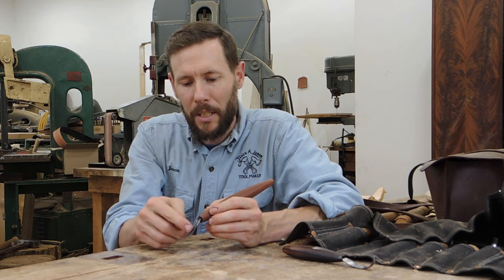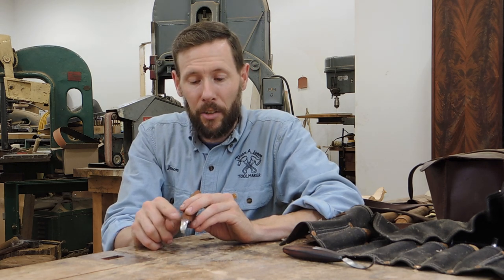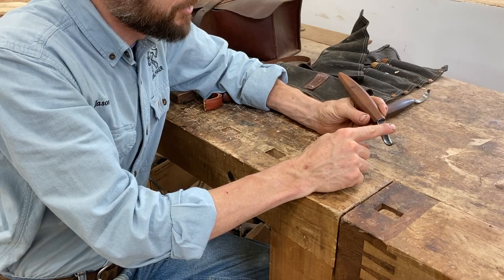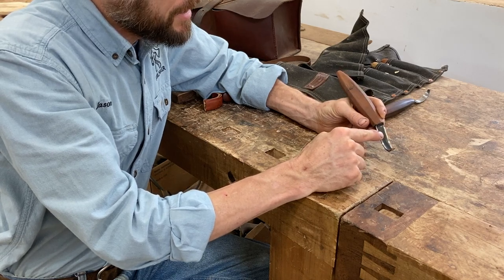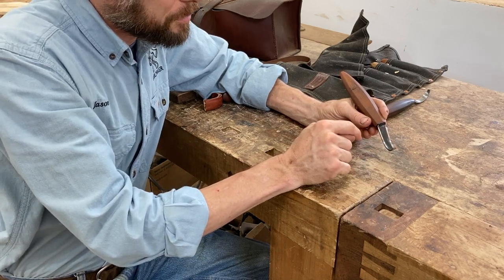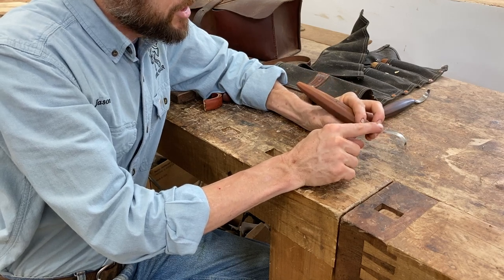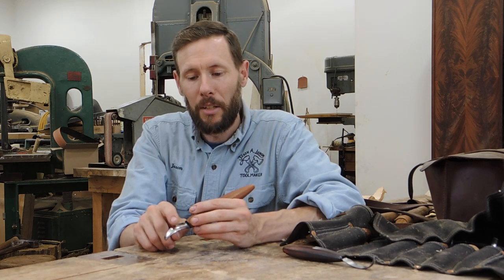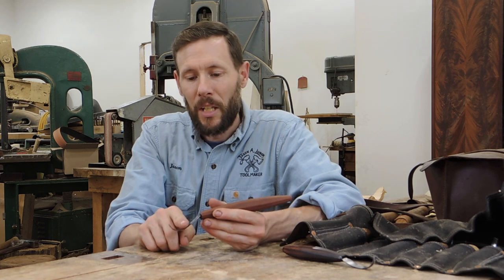That's why we've settled on a design that includes a hollow back. This blade is forged into a hollow shape and we've eliminated the single bevel on the outside. We have sort of a blended curve which matches the inside of the spoon quite well. This hollow is for ease of sharpening — it gives us a reference point on these two guide rails that keeps our sharpening flat. We sharpen from the inside of the curve and leave the outside pretty well untouched except for polishing with a strop, which keeps that same angle of attack as we carve.